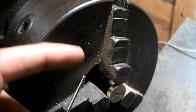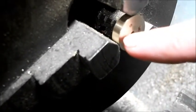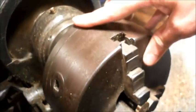I'll sharpen it so it's a bit like a D-bit, and then I'll hold it in my tool post. You can see it's a drill there with flat areas above. Then all I do is feed it into one of the holes I want to cut and rotate the chuck.